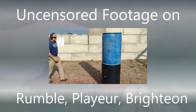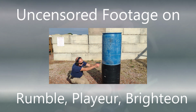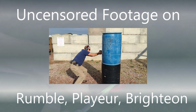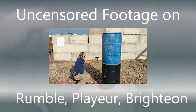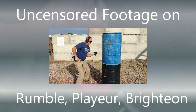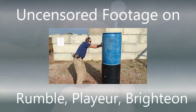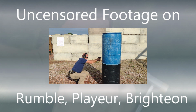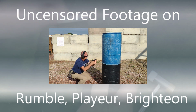Anyway, the key steps to getting inside. Remove the main spring cap. Unhook the mainspring from the pin. Drive out the fire control unit retaining pins. Note that the rear pin has a groove in the middle. While prying out a bit on the grip frame so it clears the serial number, press up on the fire control unit. For me, pressing up on the slide release seems to work well. Thus to remove the fire control unit from the grip frame.